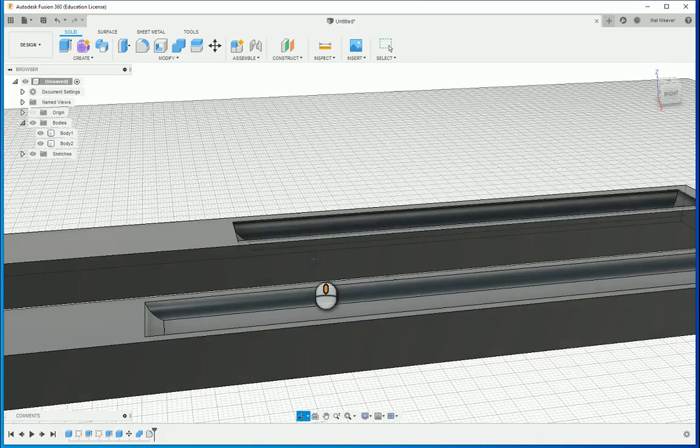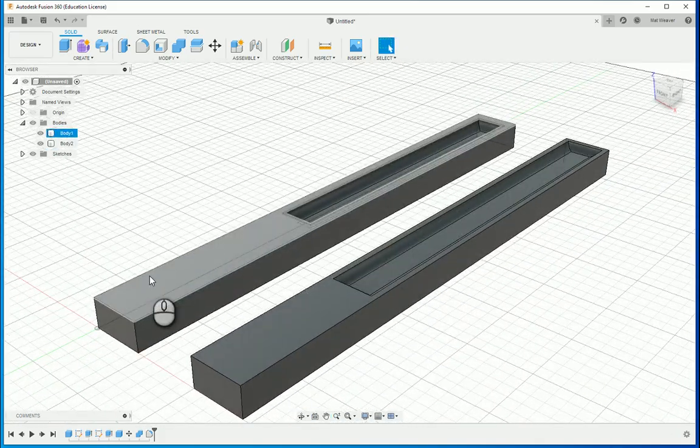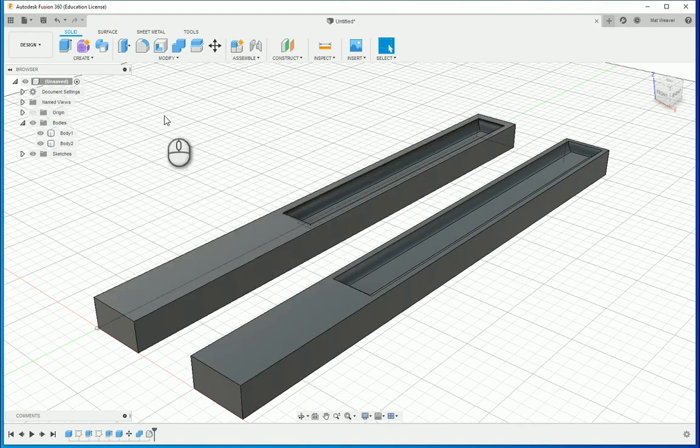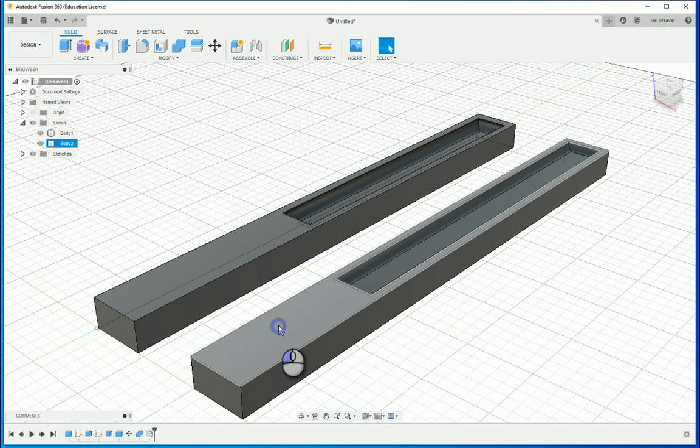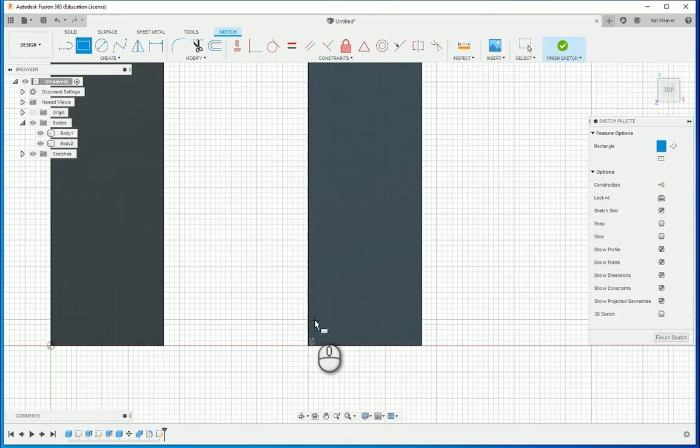So that's how you draw your ashtray, and of course you've got the video so you can play and pause it. The next thing was to draw a line across here so I can make the metal part. The easiest way is to click the surface I want to draw on, right-click, create sketch, press R for rectangle again. This time I am going to snap to make my life easier, and I'm going to draw that line — that's 1mm, which is fine. The metal you're using, the aluminium, will be 0.8mm, so 1mm gives you a little bit of space for glue.